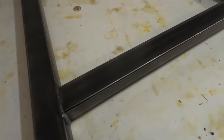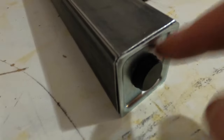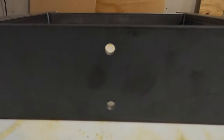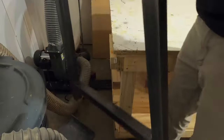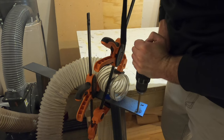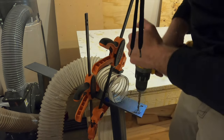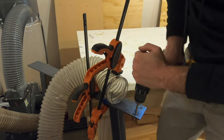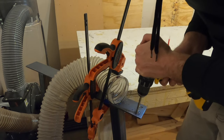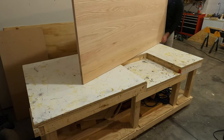Here's a quick look at the legs — these are steel legs from Carolina Leg Company, very sturdy, very stylish. One thing I really like about these legs is that they have adjustable feet in them already for leveling purposes. But one thing that I don't necessarily care for is that the holes on the top for mounting them to the tabletop are not elongated, meaning that if I put a screw or a bolt through those that will restrict wood movement as the top expands and contracts across the grain, which could cause stress or a crack in the tabletop over time. So I just elongated the holes with a regular drill bit, drilling into the steel to elongate the hole, kind of filing it out with the drill bit as I go.